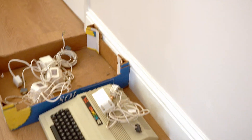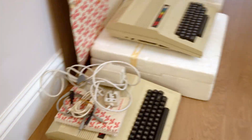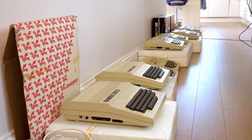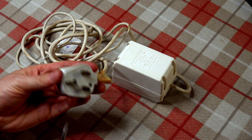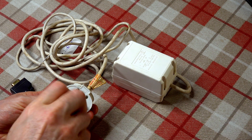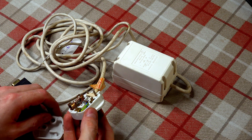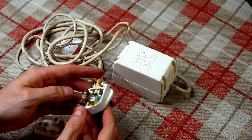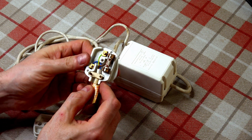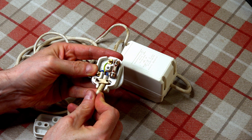So where to start? Well, before I test any of them, I want to make sure all 11 power supplies are good. The UK has one of the safest AC power plugs in the world, but prior to 1994, manufacturers did not have to provide one fitted. So always check the plug before trusting some unknown person knew what they were doing. You are likely to find issues like the cord not being gripped, and the conductors not trimmed to the correct lengths.